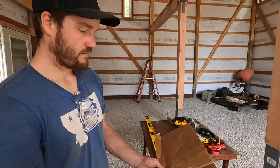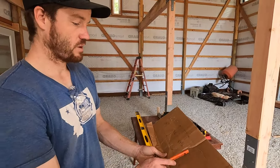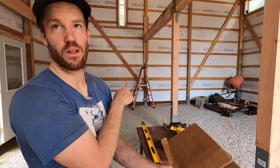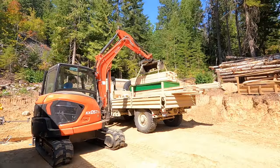Score. So we went along with the tape measure on this wall and also along our post here, and we marked all of the locations for our joist hangers. I think we should put in each one of these 5 joists to get this all set where it goes, and then we'll fill in the rest of them as we go along. Cool.